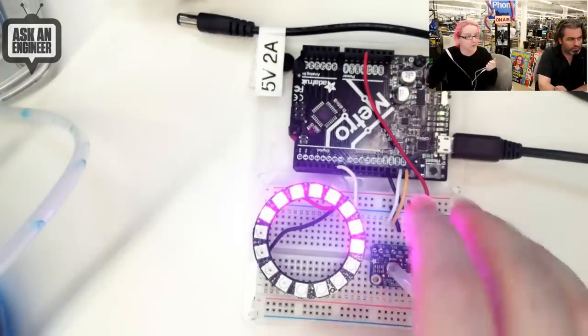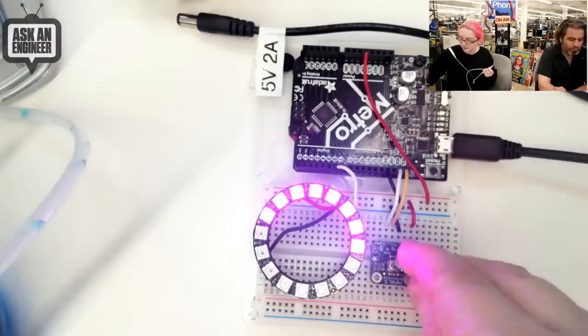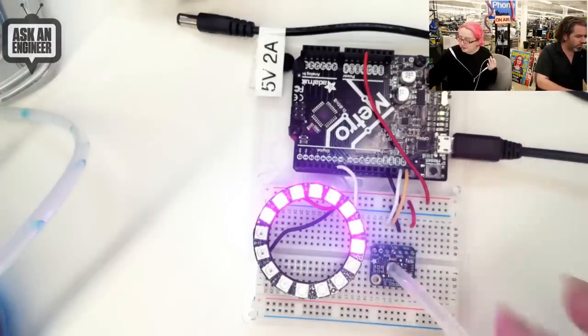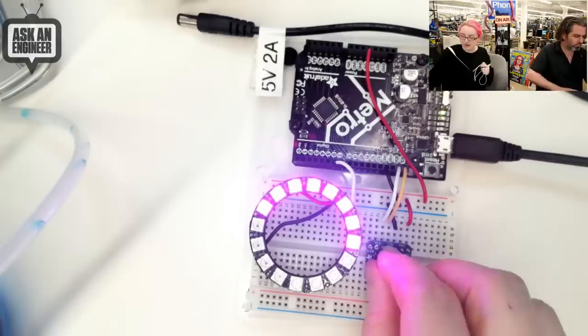So this is good for those kinds of interfaces, although I think it would be good for any kind of pressure sensing where you want to have a tubing connected. What's nice is the tubing just pops on. So this is a really nice ported sensor, and it's very high precision. It's a really nice, easy to use sensor. Again, I2C, and you can use it with CircuitPython, Python, or Arduino. So pretty much anything from a Raspberry Pi to any Linux board to Arduino compatible would be able to use this very easy to use sensor.